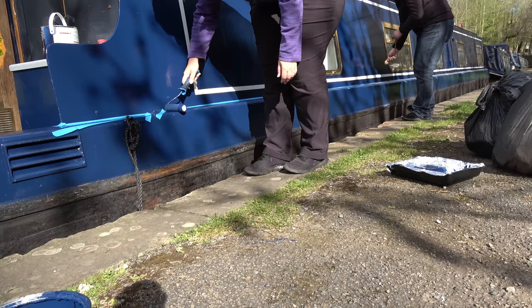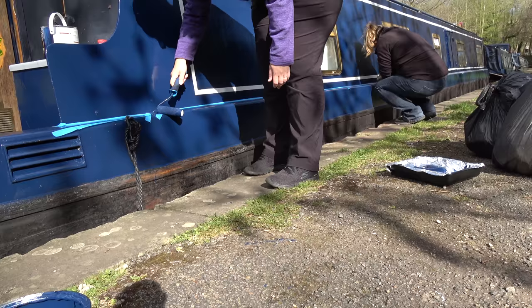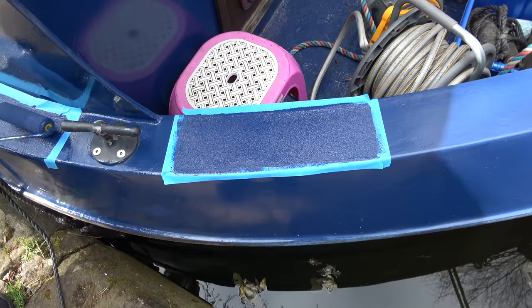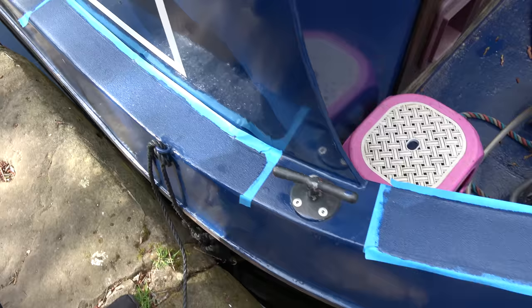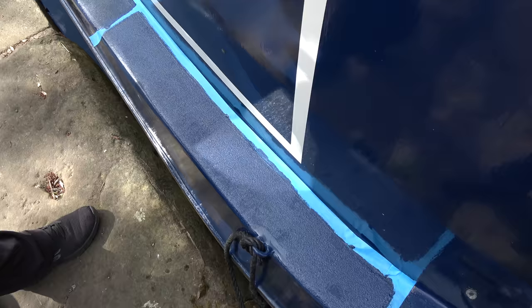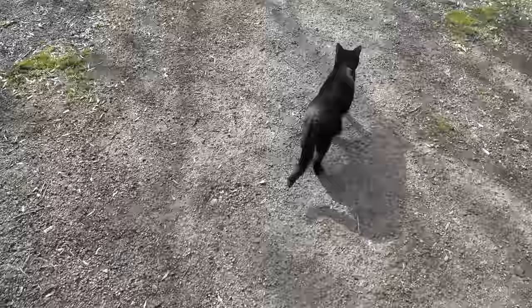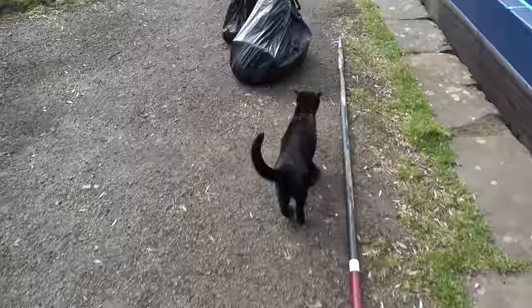I don't want to be alarmist but I think I'm getting fatigued. You're nearly there. After applying a few layers of sand and paint, we sealed it in with a diluted amount of Hammerite and white spirits. I honestly think Hammerite really comes into its own on gunnels. Now, before you flood the comments with 'Hammerite should only be thinned with Hammerite thinner' — let me say I spoke to the company and white spirits was their recommendation.